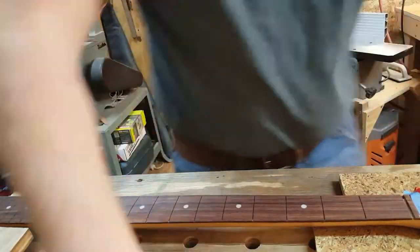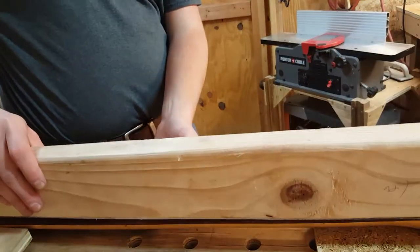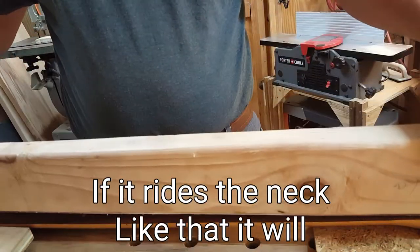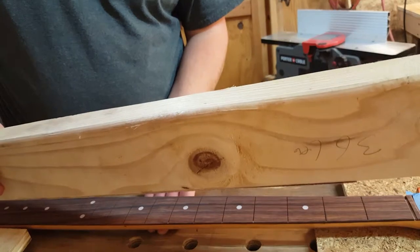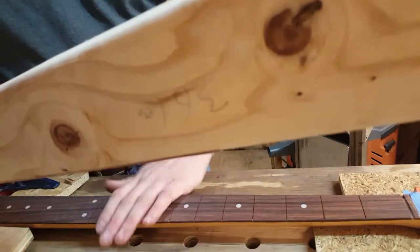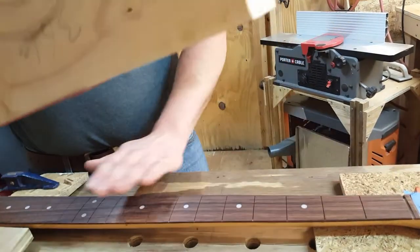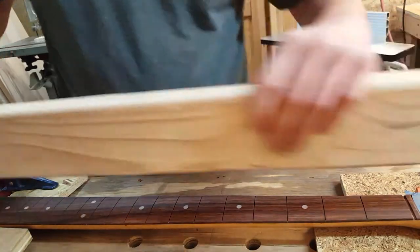What I'm doing as I'm leveling — I'm at the point where the straight edge will kind of ride the neck. So I'm holding pressure underneath here with my hand. The neck is very loose in the vise; I didn't want to alter the back bow I had established. So I'm putting pressure behind right here and leveling mainly on top — this is what we need to get down to eliminate any unlevelness and reset it so that the middle is the same height as the ends. Because if you don't, your level will ride the hump and that's no good.